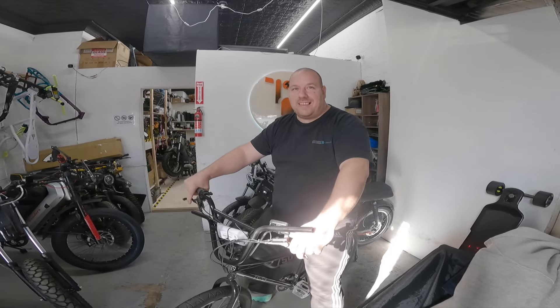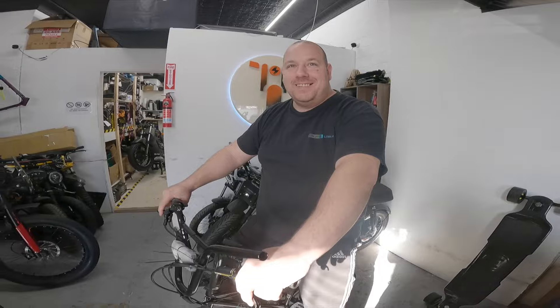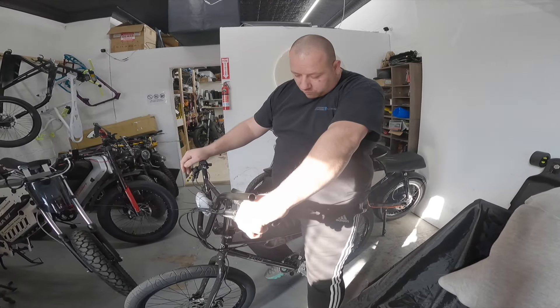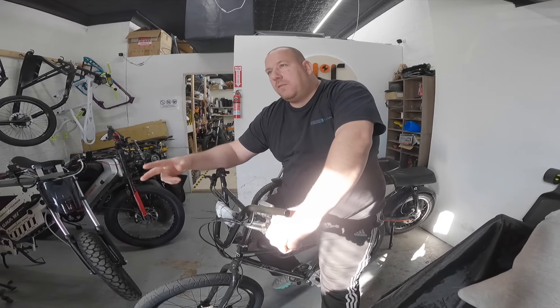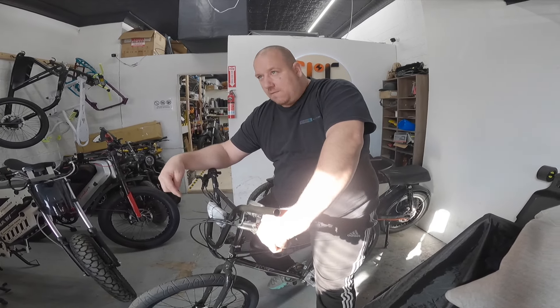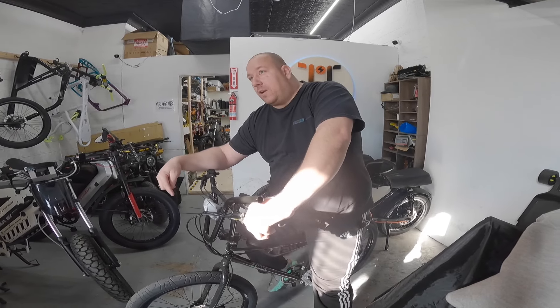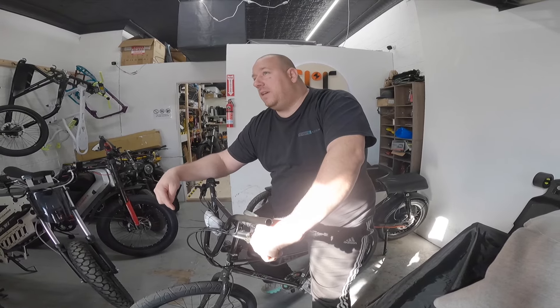So what's it getting? Oh, it's got some torque. Last time when I tested this torque in two blocks, I fried the motor. So we're going to do a five kilowatt motor, a 60-volt battery with 50 amp hours, an 80-amp Sabvoton controller, and Magura MT5E brakes with 220mm Magura MBRP discs.